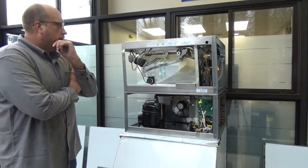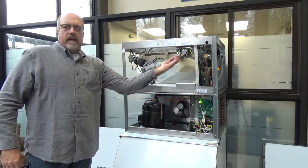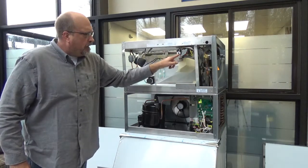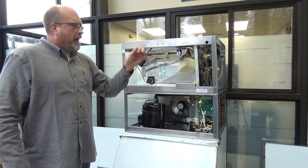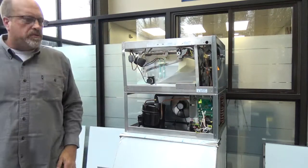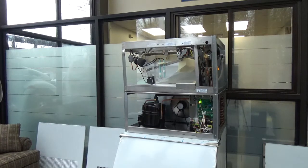If you overtighten these, there's an Allen set screw, that's how you loosen them to adjust them. If you overtighten them, you'll see them crack, and they will not read. You just gotta snug them down, don't go too tight. But if you ever have to, we have a part number, you can give me a call for a part number for both of those blowers. Until we have the other one set up for the blower.